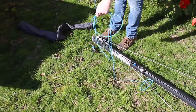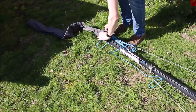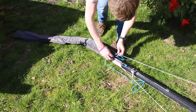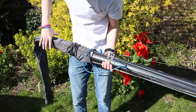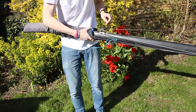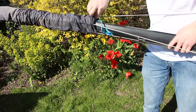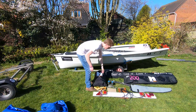With all the halyards tidied away, we can just coil them all up and put them on the mast. Then we like to put a mast bag over the top because this stops us having to waste any electrical tape and it's really neat and quite simple. We slide it over the bottom putting all the halyards in, then pull it over the halyard ring and gooseneck. The bag doesn't need to be that long — it can finish just below the halyard ring. Then we just tie it up to the halyard ring to prevent it from falling down.